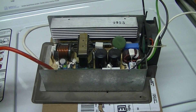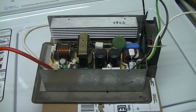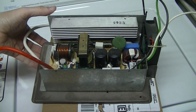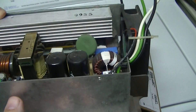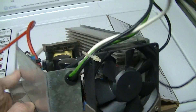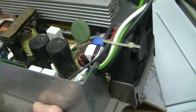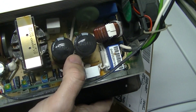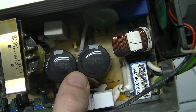WIPCO has an awesome video on YouTube — I'll put the link in the comments below — on how to remove this unit from the power supply in the trailer. But once you get it out, you can see fairly clearly that these two caps, the large filter caps, are a little bit swollen — actually a lot swollen. You can see from that angle the bulge in the top, and if you zoom in you can see how it's actually pulled away from the side.